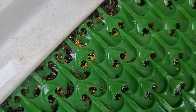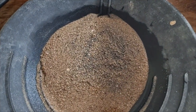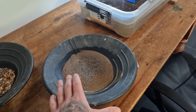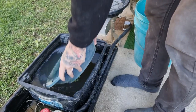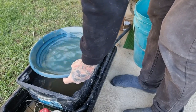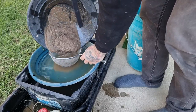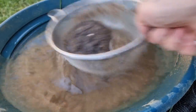But the pitch of your miller table doesn't change the fact that little pieces of round gold can roll off the end, or little pieces of gold with shape can catch the water like a sailboat and get pulled off the end. These concentrates are from my last two videos, where in total I recovered 1.9 grams. All of that concentrate ran over that miller table to collect. But that was before I added the scratches, and I'm willing to bet now that it's all scratched up I'm going to recover a lot more from the same concentrates. So I'm going to rerun it and see just how much gold this miller table has been losing.